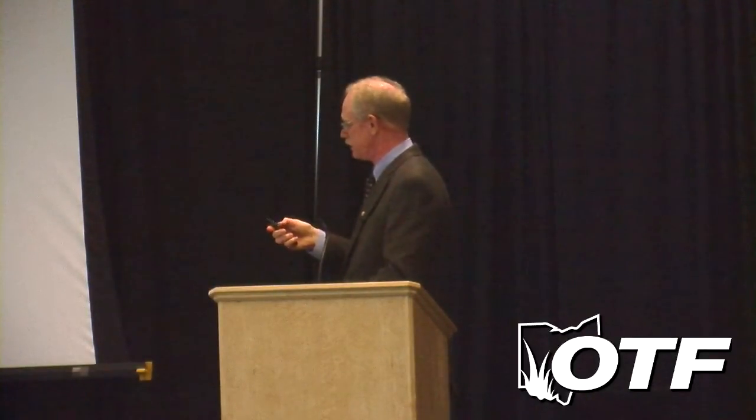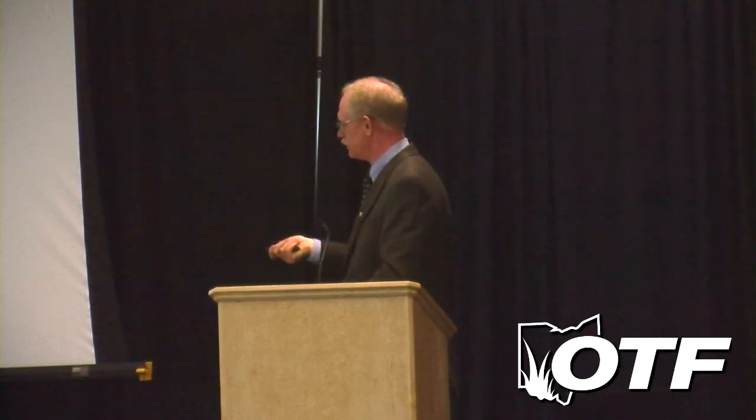So you hump up the stone a little bit, and then before the sand is placed, you've got to come in and recess this. We like to see at least 3 inches of recess down. That gets that stone down there, and that really preserves your bunker and really helps with the pickiness of your members and any costs associated with it.